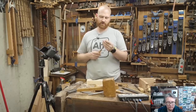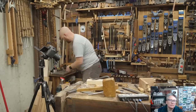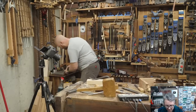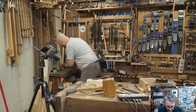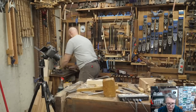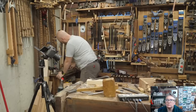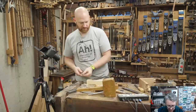Before I start banging I'm going to sharpen this chisel up a little bit — my three-eighths. I use a little window cleaner and go coarse, medium, fine, then strop. Make sure I got a little on the back, wipe off the window cleaner, go straight on the strop: one, two, three, four, five, six, seven, eight, nine, ten. Put it over on the flat — tip, back, tip, back. Now we are very sharp. I'll use a softer, lighter mallet because I don't want to be bashing this apart and breaking these thin pins off.